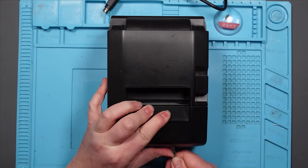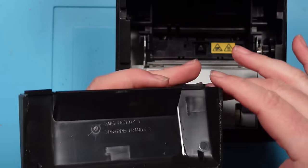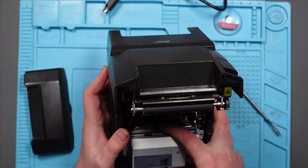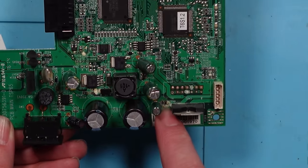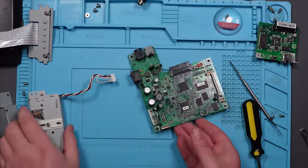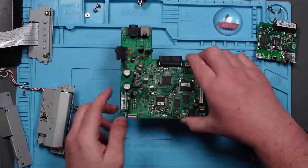This one's particularly crunchy - it's stuck down with like five-year-old beer. Okay, well let's take this apart. This one doesn't look as bad, but I can see some spots here and maybe over here as well. Let's get this under the microscope and have a look. I'm not sure that's the problem - I think it might be something in the cutting mechanism, because obviously it said it had a cutter error. So I might need to open that up, but I can definitely see corrosion. Let's start here.